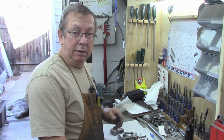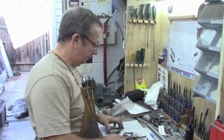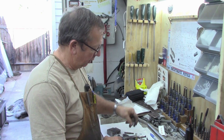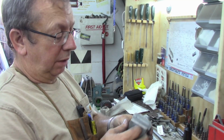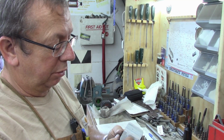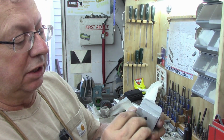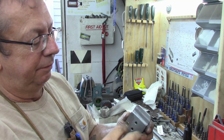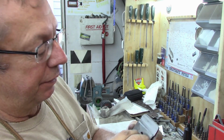I ran along and just made parts. So I've already done basically everything I needed to do. I've got some polishing left to do on my upper arm, but on my two side blocks, you saw me run them back to back, run the screw through them. They lined up pretty well there, and all I did was cut my little bevel. I took about 70 thousandths, probably 60 thousandths, something like that, off of the side of them.